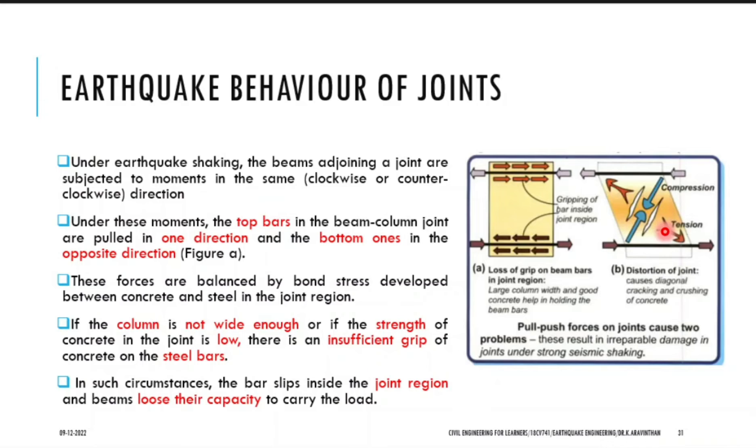Steel is a flexible member; concrete is a rigid member. So you are combining these two, which increases the flexural rigidity. This is also the reason for constructing shear walls — a shear wall is construction of a wall using concrete and steel. If you construct a shear wall it helps during seismic force because it has more flexural rigidity. Hence it can withstand the force and cracks will not get developed.